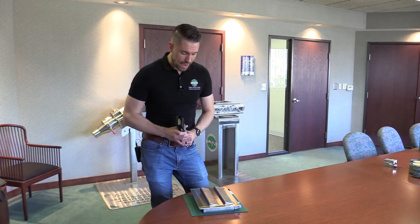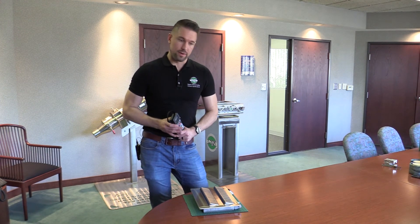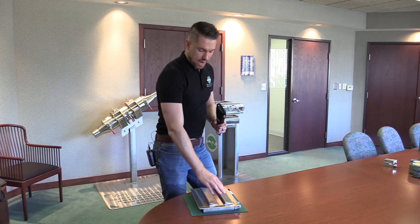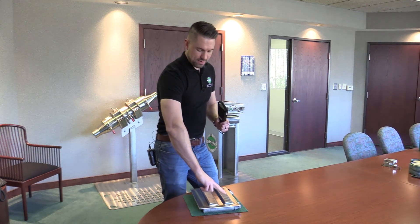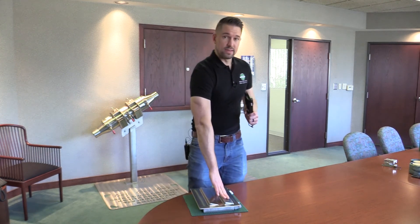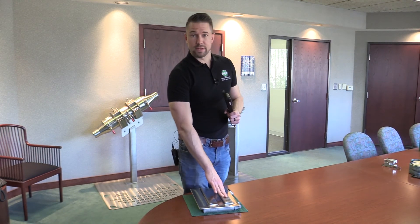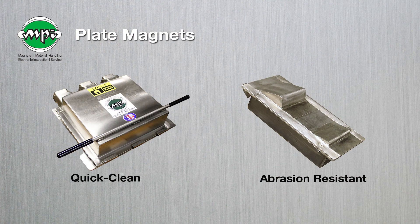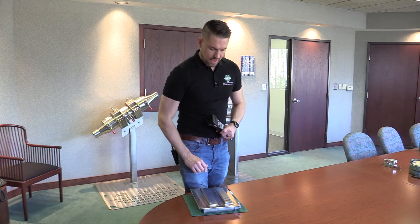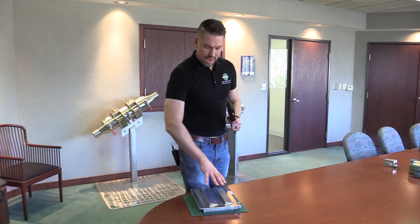With plate magnets you can see an increase in readings if you're running an abrasive product, because the product running over the steps will start to wear them — generally in the middle — and you'll eventually see a lip form. If you're running an abrasive application, a quick clean design or our abrasion-resistant design are good options, as both have replaceable faces that protect your investment and only require replacing the wear surface.